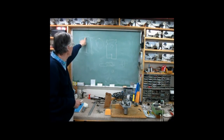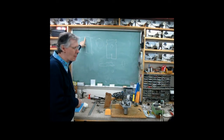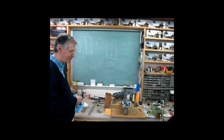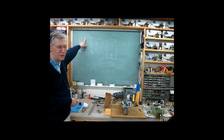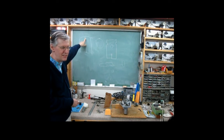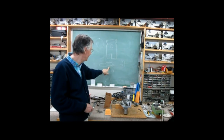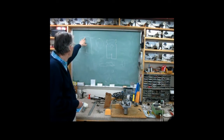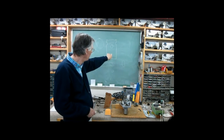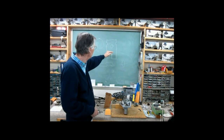And so as this wears down at this setting, you get down to 3 mils. Well, that's basically down in your runout area on the drum. Now remember this 1 mil safety margin. So you get into that area when you wear this down 3 mils approximately at this setting of the lobe on this offset pin. Well, when you reach that point, then you can rotate this pin 180 degrees around to the forward side of the lobe, and that moves this out.